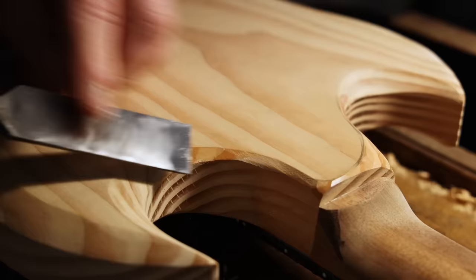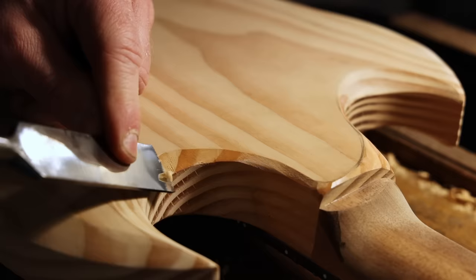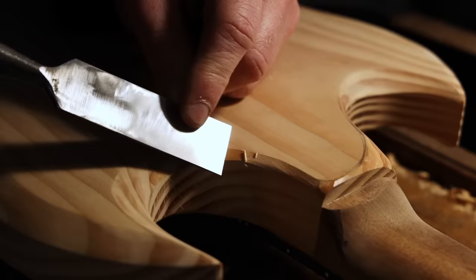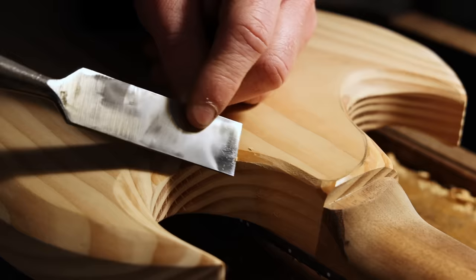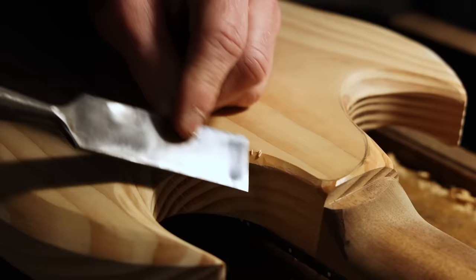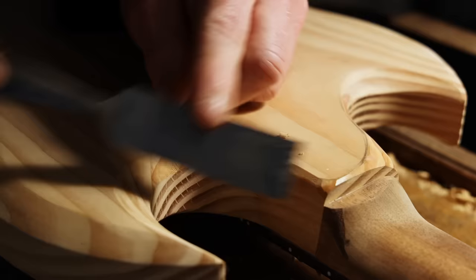Working the softwood, you've got the harder striations, the harder grain, and it's really difficult to keep an even line when you're using a bladed tool like this, or actually for that matter sanding. It's part of the character of the stuff, I suppose. It's part of what gives a guitar made in this stuff character, to speak more precisely. And I kind of want the hard edge on that line to slowly evolve into a soft, smooth transition.